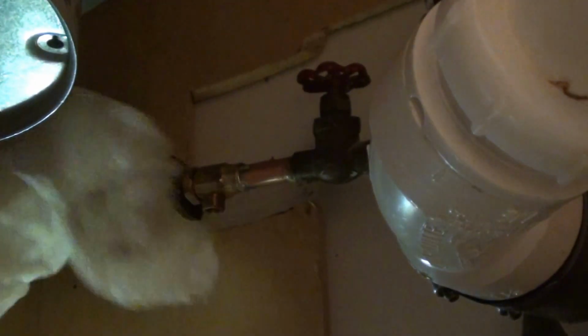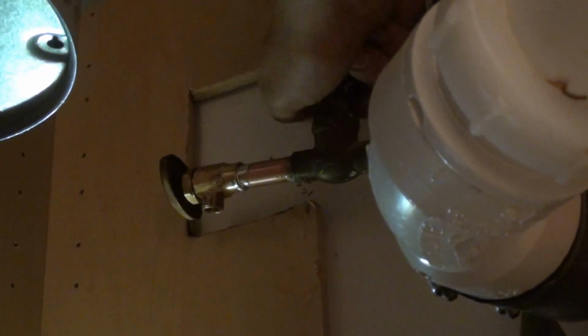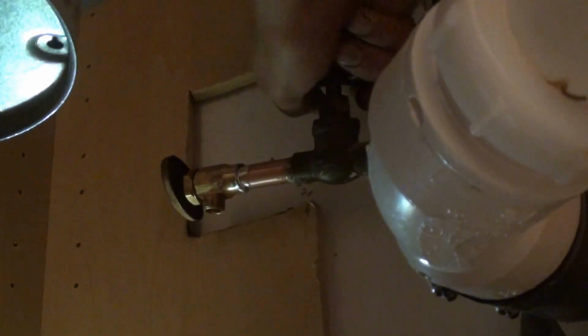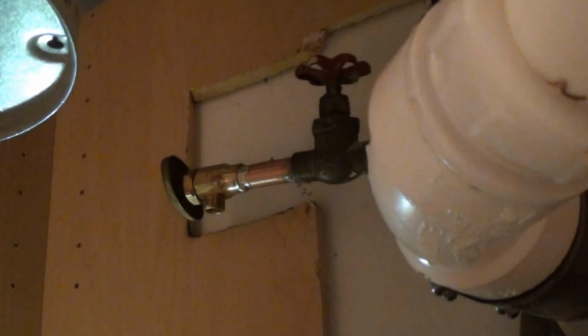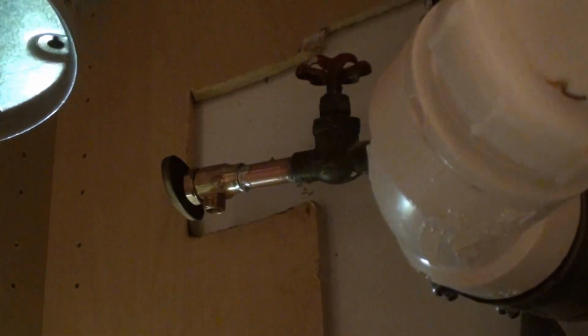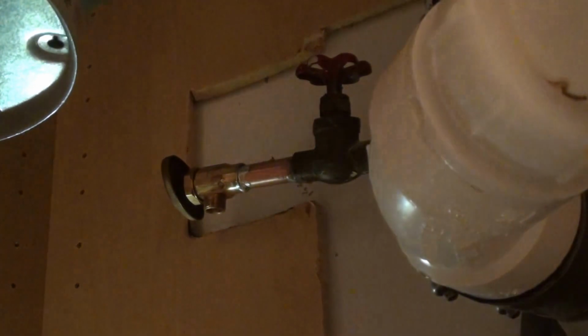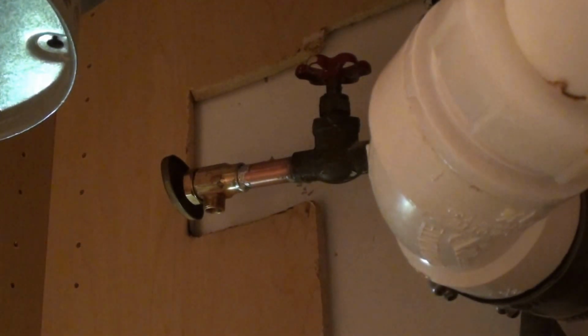Alright, so that's pretty well off. We'll turn on our globe valve and make sure. Yep, looks good. I heard the water move. And everything's good to go. So we'll keep that pressurized the whole time. That way if it does have a very small leak on it, it'll do it before we go. Everything was clean, everything bled real good on it once we heated it up, got the solder to temperature. So I'm sure there's no problems, but it's a good precaution to take.